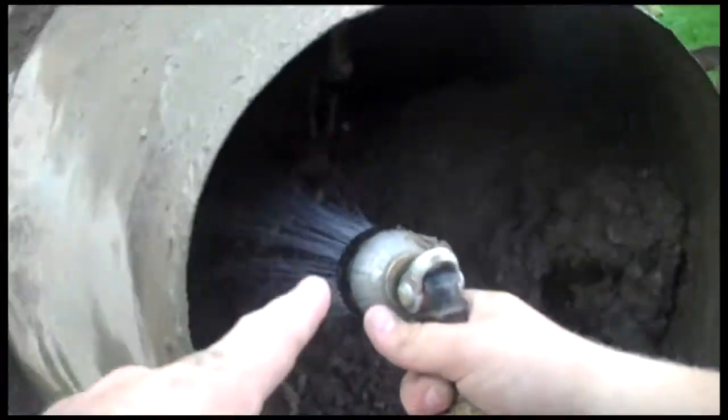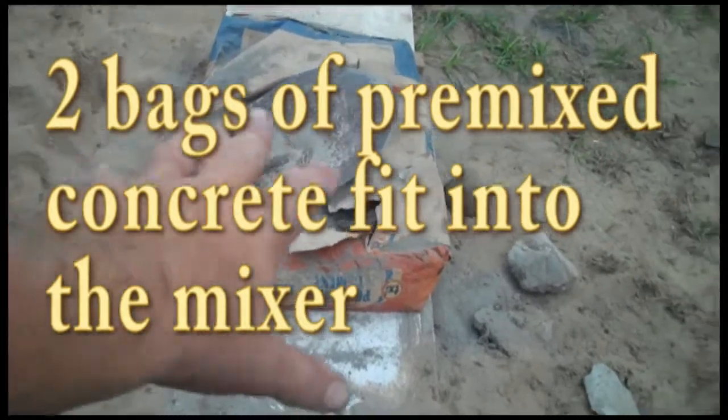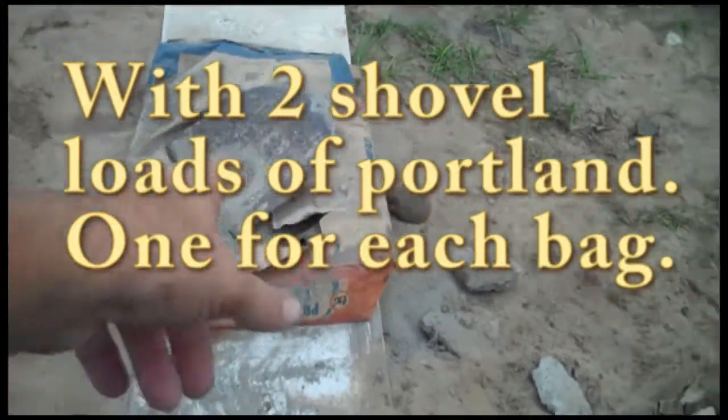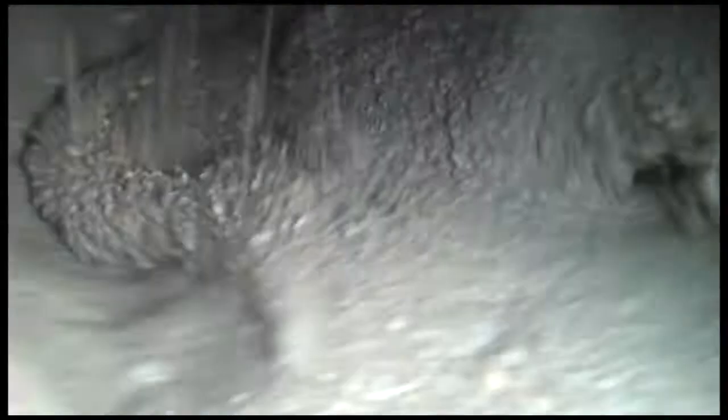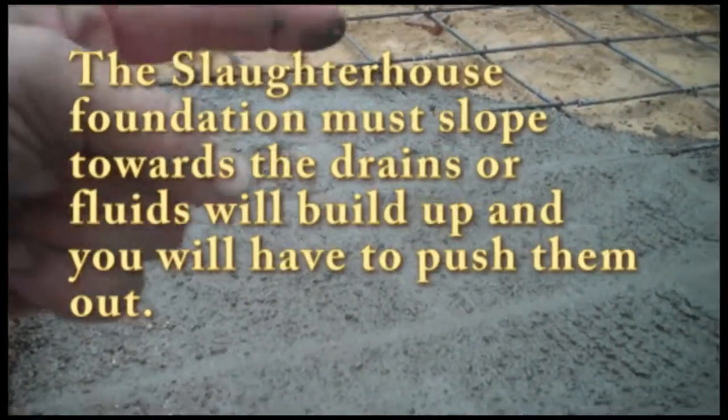What John's doing is just mixing the water into the concrete. We put two shovelfuls of Portland — just add what you want to it — and now we're just making it soupy. It needs to be soupy to be worked with so they can spread it on the foundation. You can see where they've been working — they've got it around the pole already, the foot, and have been working with the trowel to smooth it out. It's going to be angled — higher here than it is at the drain.